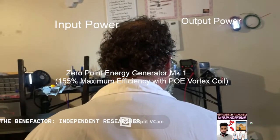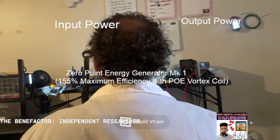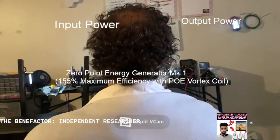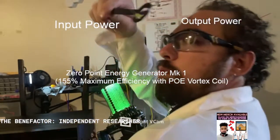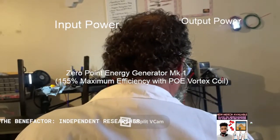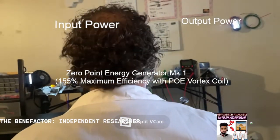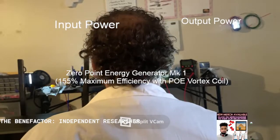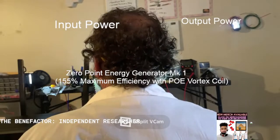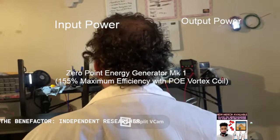Mike says those battery-powered pole detectors are not so reliable. I use the real magnetic. But unfortunately with this coil, it's hard to detect that with the traditional. To verify it is getting an electromagnetic field generated, use one of these bad boys. There's an LED stuck to this. But it only gets you so far as to determining the monopole. Really, you need the digital pole detector, and this is a very cheap one. So take this pole detector with a grain of salt, because we might be detecting one and this pole detector isn't sensitive enough to pick it up, type of thing.